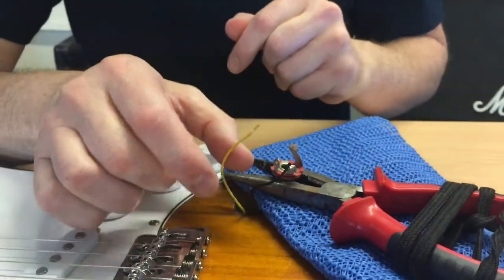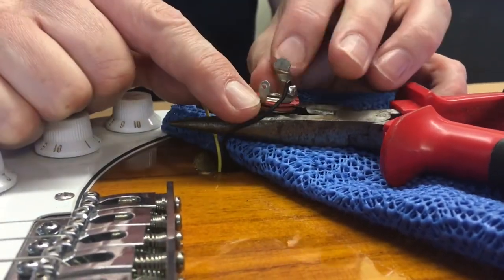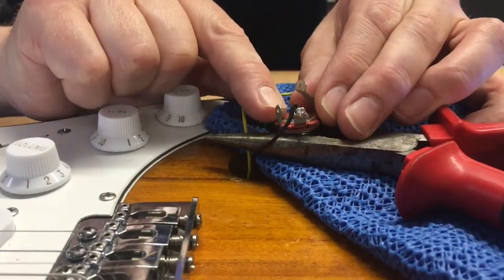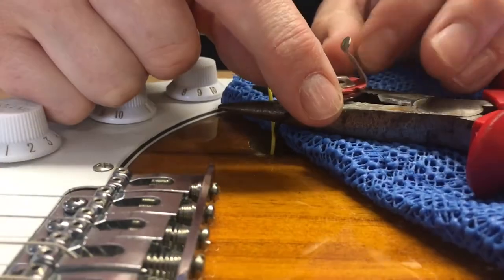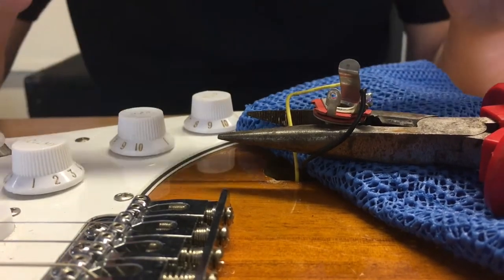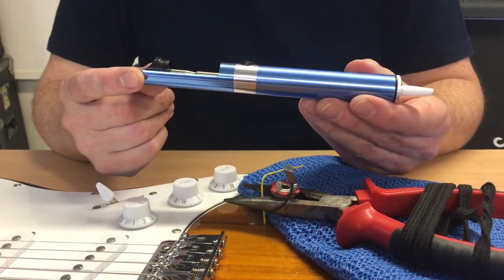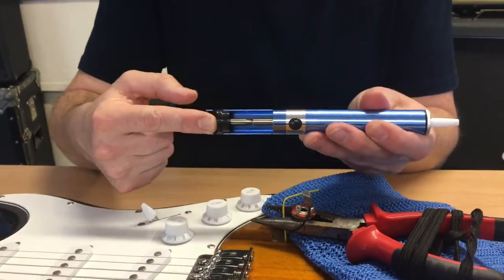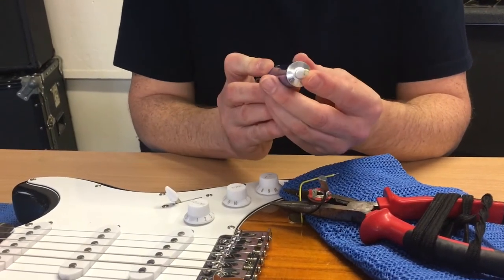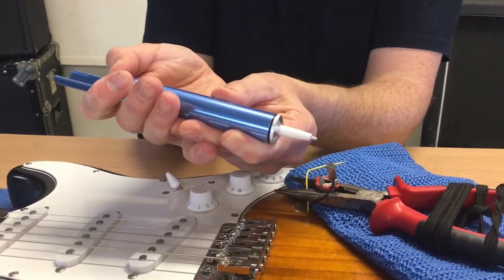There we go - that's more than plenty. Now, the next problem is it's going to be resoldered onto this connection here and there's what's left of the old piece of cable on there where it's snapped off. So we want to clean that up and remove it. We're going to use the soldering iron. We also have another gizmo which is called a solder sucker. This works by pushing the plunger down and pushing this button - it releases, and on the end it sucks up any excess solder, then pushes out any old solder.